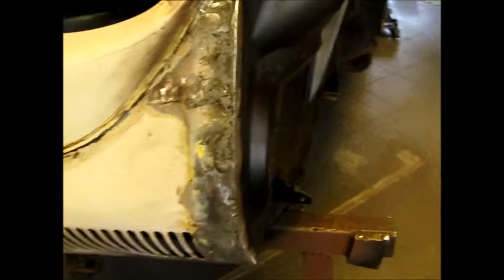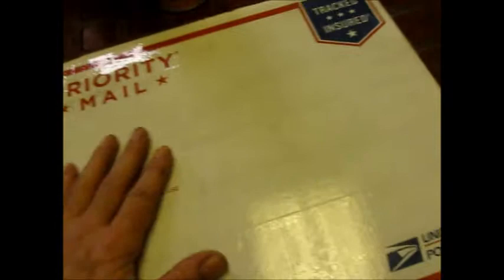And I'm going to come here now, and we're going to do a little dent removal and a little sanding. And I'm going to put some Bondo on that, and I'll show you guys that. There's a little Bondo there, and a little Bondo here. And a little tip and trick, for those that just want to do something quick: cardboard is cheap if you've got a lot of it around, and packing tape. If you do any shipping or you have boxes and you like to have packing tape around in any way, shape, or form, take a piece of cardboard, cut it to the size that you want for the Bondo you're going to be working on, and put packing tape on it.